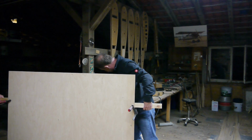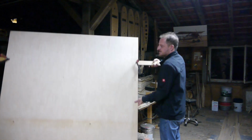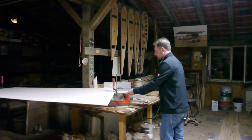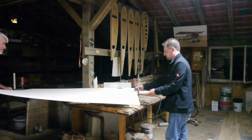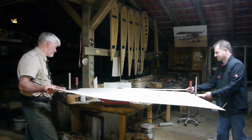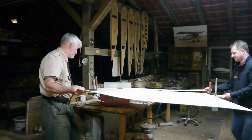Sometimes it happens that you have to cut big, floppy, not very handy big sheets of veneer or plywood. I used to do this with my fine table saw. It makes very straight and very fine cuts and doesn't fray the plywood. Could be done faster with a bandsaw, but the plywood does fray with that one, and I don't have enough space around it to put the big plates through.